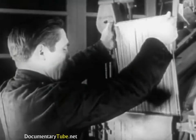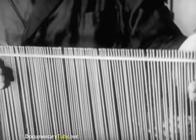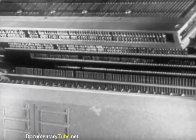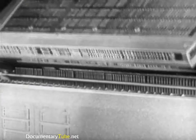Similarly, on every machine, corresponding to the 90 keys, there are 90 key rods which make up the assembled key rod frame, situated behind the assembler entrance, bringing the keyboard into play with the magazine. Here are the upper ends of the key rod, which rock escapements situated in the magazine, thus allowing the mat to be released.